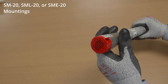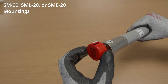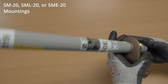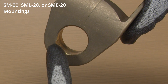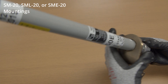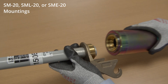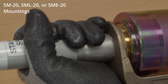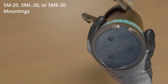The lower end fitting must be attached first. Unscrew and discard the red cap located on the lower end of the fuse unit. Next, slip the lower end fitting over the upper end of the fuse unit and slide it down until the locating slot inside the lower end fitting is aligned with the locating pin on the lower ferrule. Seat the lower end fitting against the shoulder of the lower ferrule. Then thread the silencer onto the lower end fitting and screw it on firmly. The final fractional turn should be made with a bar or wrench handle applied to the base of the silencer.